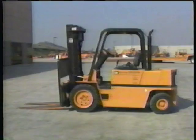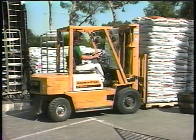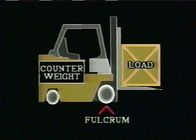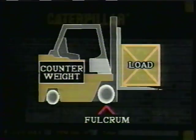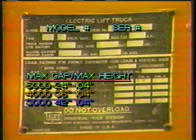Let's review a few engineering principles so you'll have the knowledge to make your own decisions and exercise good judgment. Forklift equipment operates on the fulcrum principle — two weights are balanced by a fulcrum. The counterweight, or engine and heavy metal parts, counterbalances the weight of the load. The fulcrum point is your front tires. The data plate attached to your forklift provides the serial and model numbers, and tells you how much weight you can safely lift and how high the forks can be raised.